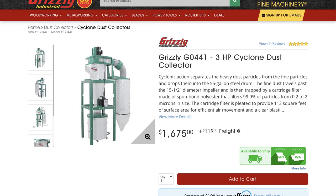You can obviously buy one of these cyclone dust collectors directly from several manufacturers. I'm a Grizzly guy — I prefer their products, I think you get good bang for your buck — but there are a lot of other options. For my dust collector I paid right around $500, and then the cyclone off eBay was around $250. With the steel and everything else I was probably around $1,000 total. If you're starting from scratch it might just make sense to purchase one already set up, unless you want a very specific shop configuration like I did — I wanted to keep it tight against the wall.